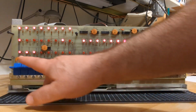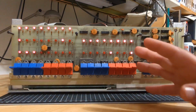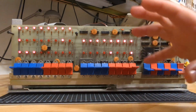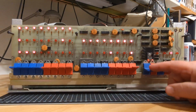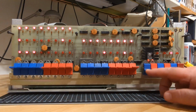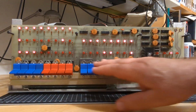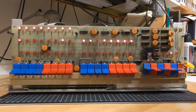And it continues on. And of course, because none of these addresses, due to the fact that these two bits here are ones, are mapped into our memory card, every time I read any value, it's coming from a high impedance bus. So again, we always see all these data bits set to ones here. All right, let's go back to looking at the data that's in our memory card here.